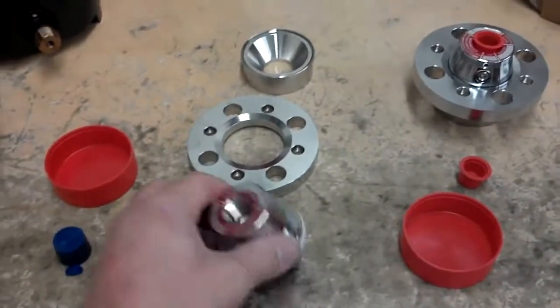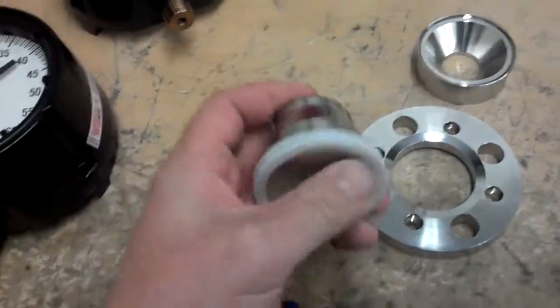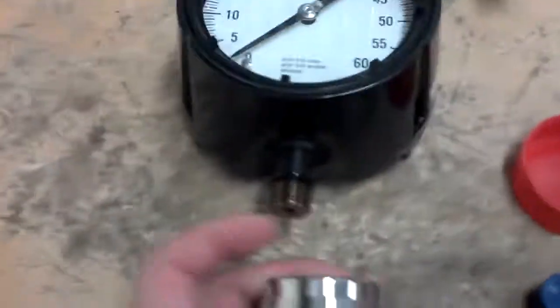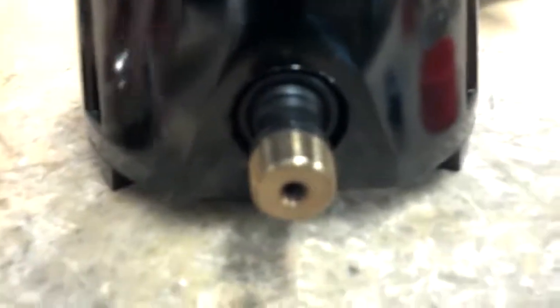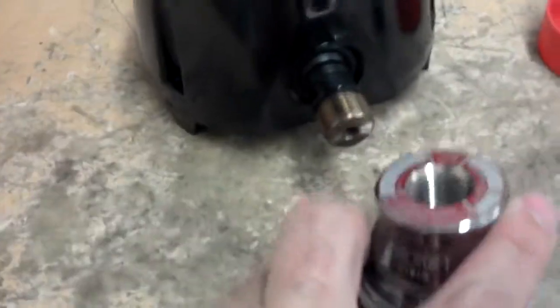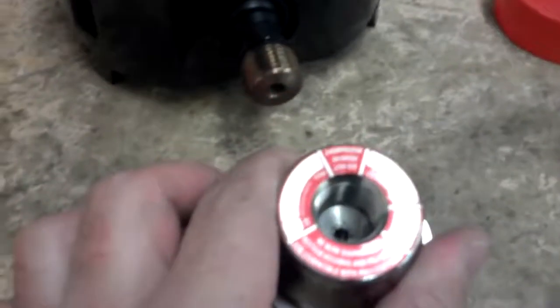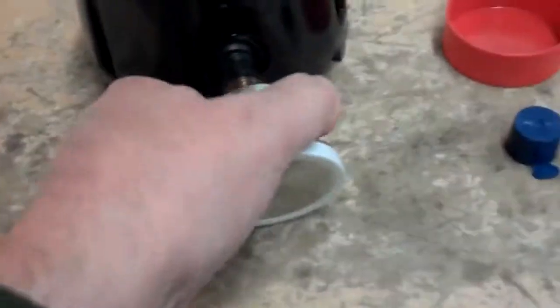Okay, so here we have the top housing of a diaphragm seal, and the gauge that's going to be mounted on the seal. As you can see, there's a cavity inside the gauge where it goes up into the side of the Bourdon tube, and this is the top housing. It will connect like that. This is the actual sensing element where the pressure will be applied, that it's going to translate to pressure being built inside the fluid, sent up to the gauge.